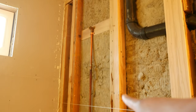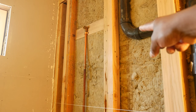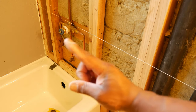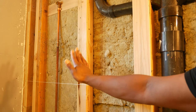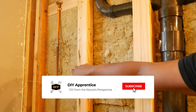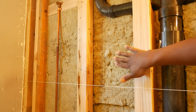On the next set of studs you can see some rot in the stud, so I decided not to shim the face and instead sister alongside it. Screws are staggered every 16 inches on center — I've got three screws installed. I had to notch out for the tub lip right there because it was impacting the stud. One important thing that almost tripped me up: the original stud was installed at an angle, not straight. When I installed the backerboard it kept catching on the side of the stud and created a hump when I drove the screw — I took the board down and found the stud wasn't straight.